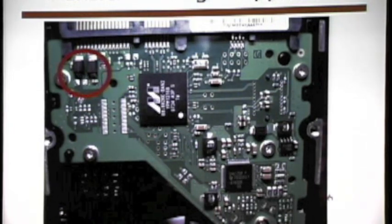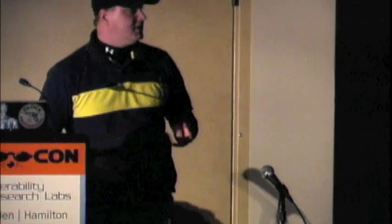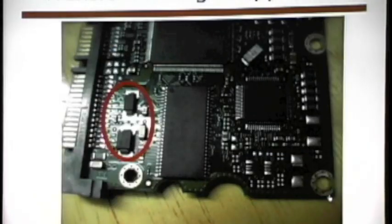Well, on hard drives these days, you'll find these on the bottom of almost all of your 3.5-inch hard drives. There will be these two fuses. Basically, these suppressors, the smaller one is 5 volt, and the bigger one is 12 volt. Now, I'm not just saying let's go rip these off, okay? If you have no other alternative or you can't find a meter and test them, there is an option. It really won't do much damage.